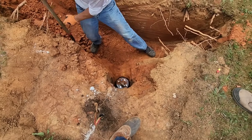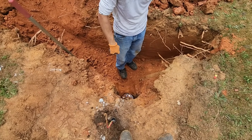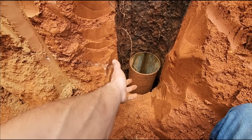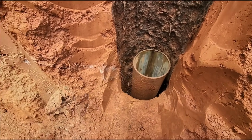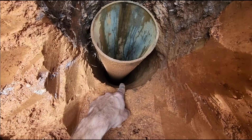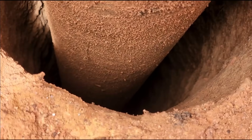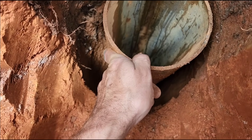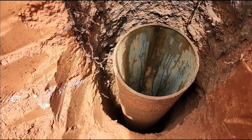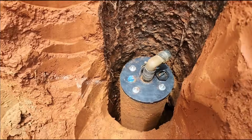We had to do this part first before we could do any other part. Got a wire brush? I'm going to go to the truck and get one — get your little drill with the wire attachment. What do you think of a liner? Yeah, it needs to be lined, but I told them we needed to do this first because you couldn't get the pipe through there. Okay, let's get that wood out of here. So now what we're finding out is 10 feet down there's another joint — it's not welded. It's doing the same thing 10 feet down, but luckily it's still lined up so it can get a four-inch liner once it's raised. It has to be lined in order for rainwater to stay out of it.